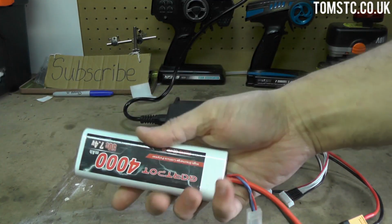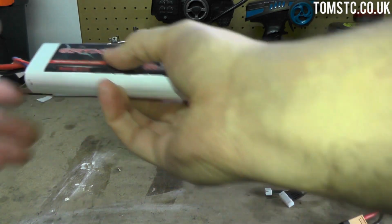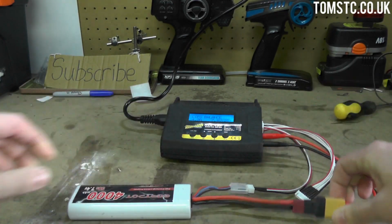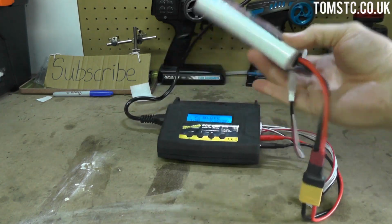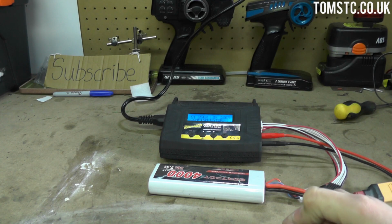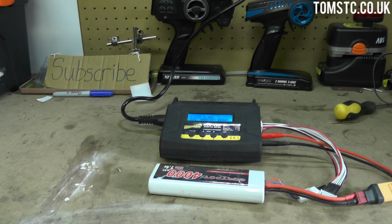So we plug in our battery. Here's our first guy. Plug it in like so, with the battery connector and the balance charge connector. And we press start, press and hold start. The battery charger will confirm that it's a 2S battery, and press enter and start. And we're not going to watch that charge for an hour. We'll come back in a little while to see how well that's gone.